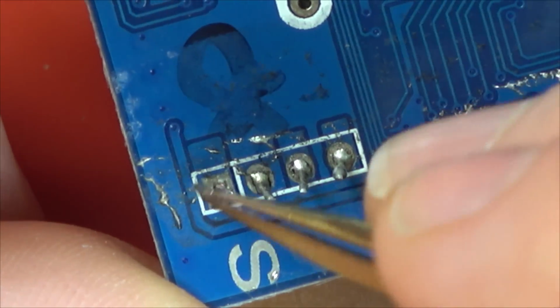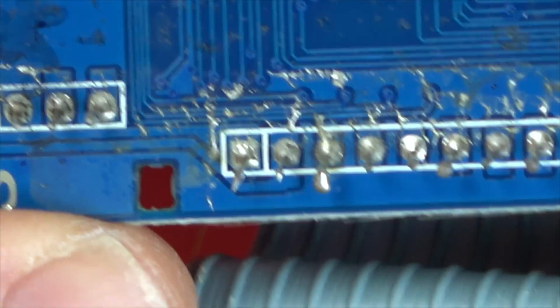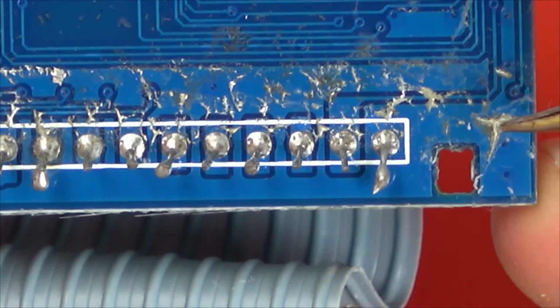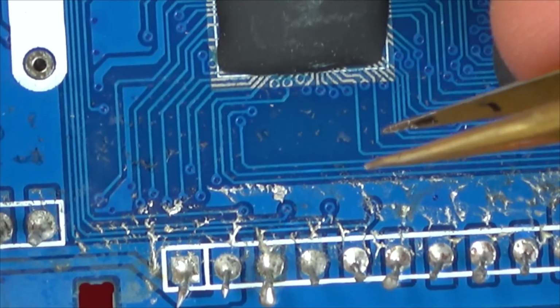No, it is soldered here. Soldered very badly. And that does go up to the outer one, which is the VDD. I don't think it's that. Right now, let's go back to the solder. Is anything bridging? It's an absolute mess, but I can't actually see any obvious bridges between two of them that would knock it out.